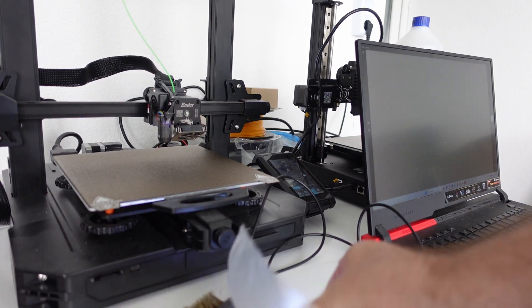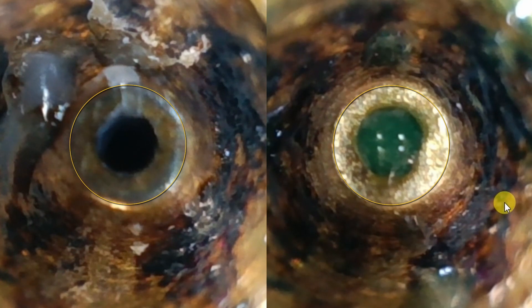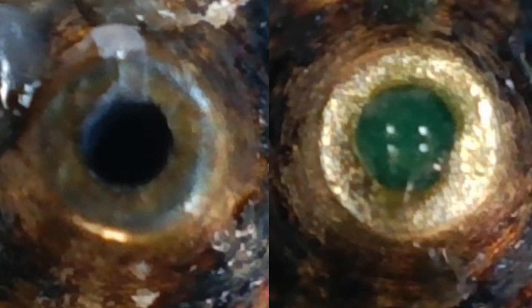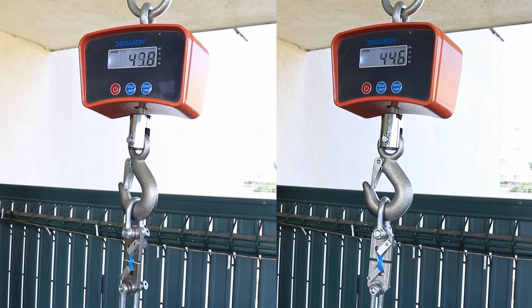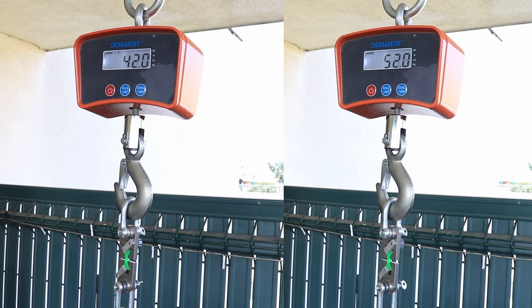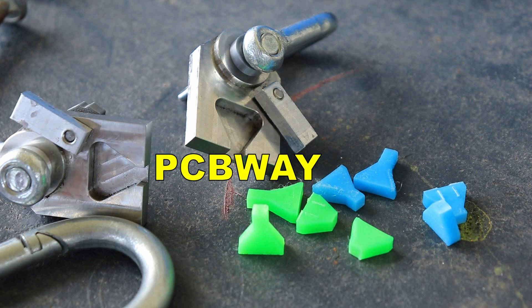After approximately 4 hours of printing, let's analyze the nozzle with the Ember prototypes camera. Here you can see it before and after printing side by side. It's not too obvious, but I can see a very polished surface on the right side after printing, so I don't feel too comfortable printing this filament with a brass nozzle. For the layer adhesion test, this object has a smallest cross-section area of 4x4 mm and held about 50 kg — very good for PLA. Very similar results with the green PLA as well, so basically very strong layer adhesion. These two holders I got from PCBWay using their CNC milling services.